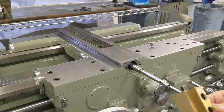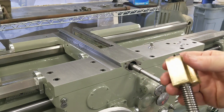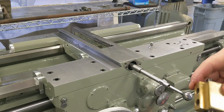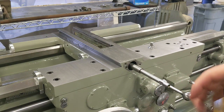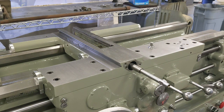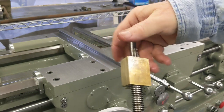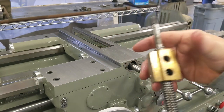So I got the nut assembly and the bearings back off. You can see this side is threaded — the bolt holds onto this and there's a locating pin that goes there. You just have to make sure this is in the right orientation. I used the cross slide base as the reference to see which side faces which. One of the things I'm trying not to do is edit out the mistakes or missteps, because that's how we figure out how to do this stuff. You can see this is left-handed, so we'll just get that on there.